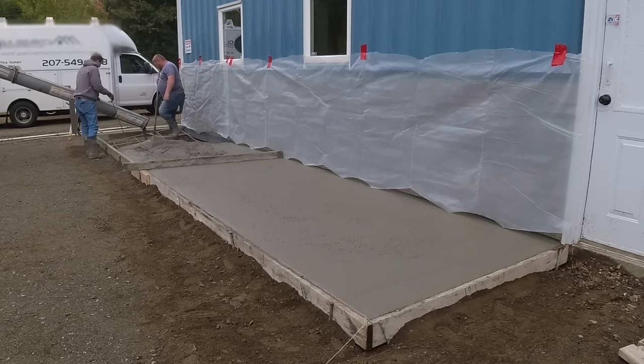That's kind of what the rocks look like under there. Right now there's no secondary color added so everything looks a little bland, but we're just looking to texture the concrete with the rock texture — just get it to look like rocks. There are all kinds of different ways you can color it afterwards. If you really wanted to get fussy with the colors, you could individually stain each rock after the fact the next day or next week after it cures — literally paint brush on different colors for each stone. We don't get that crazy with colors, but I've seen others do it and it does look pretty cool.